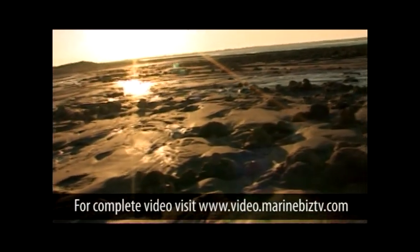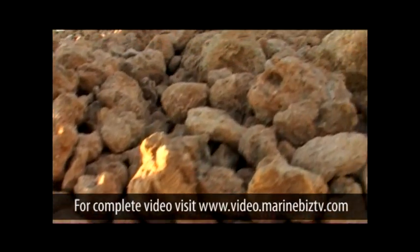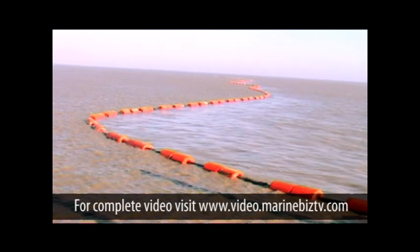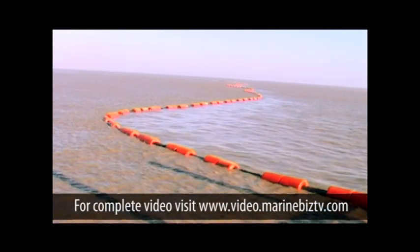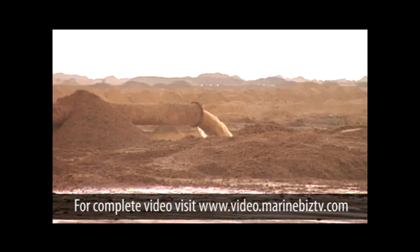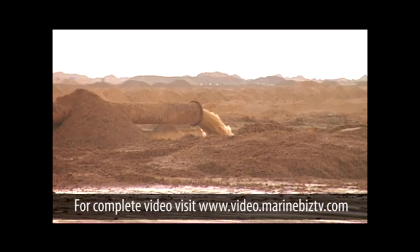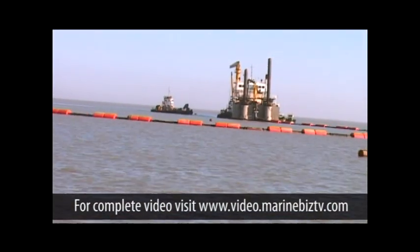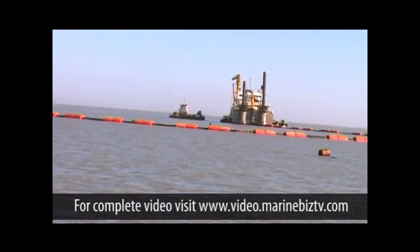However, this ratio shall essentially depend on the material being dredged, the capacity of the dredger, and the distance to which the material is to be transported. The materials have to flow out smoothly through the pipeline using proper pumping. If this does not happen, then additional boosters have to be deployed to ensure free flow of materials.